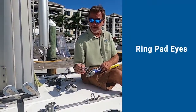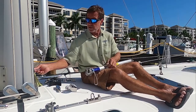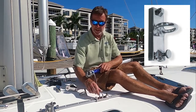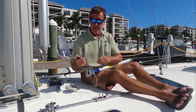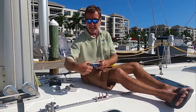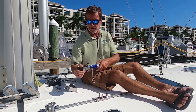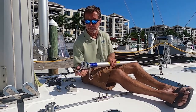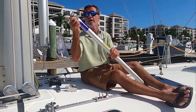When using a whisker pole with a ring car — sometimes mounted permanently on the spar, or sliding on a T-track — it's very important to use at least one-and-five-eighths-inch ID. Otherwise they bind; they need to clear the beak fitting. One-and-five-eighths will keep you out of trouble, because with so much leverage you can crack the end fitting. We don't want the pole coming down on anybody. These are typically not stored vertically on a spar.